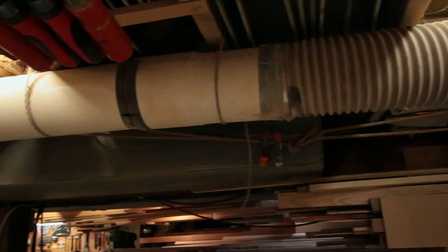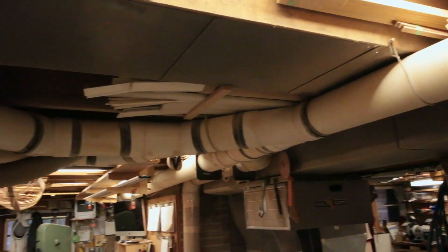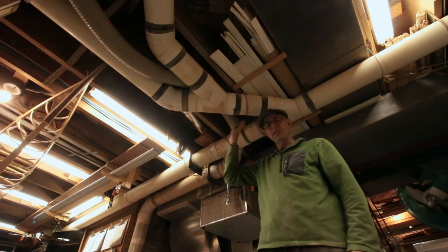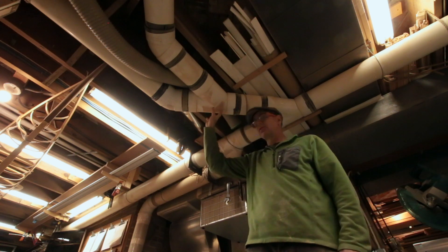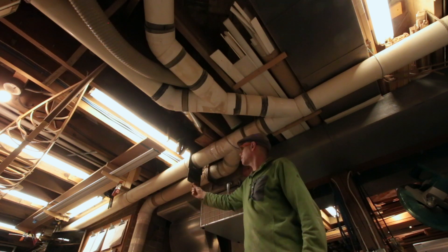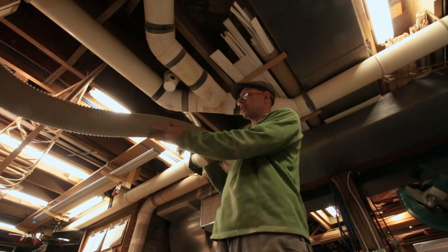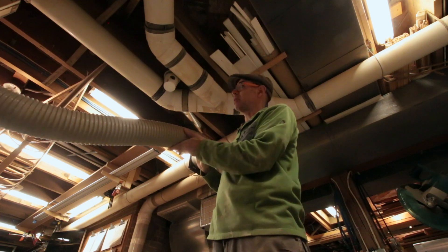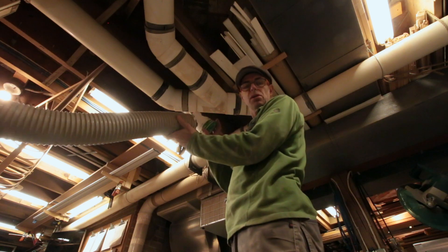One of the secrets to a good dust collection system is you want really large pipes for carrying your airflow. I'm using 6 inch PVC. You want very gentle transitions from one direction to another and as few of them as possible — that's why I'm using Y's and very few 90 degree elbows. The fewer the gates the better. You want to keep your flexible pipes as large and as short as possible. They have a pretty good smooth flow inside but they're not as good as straight pipe. This hose that connects to my thickness planer — I just use a yogurt container for a gate.